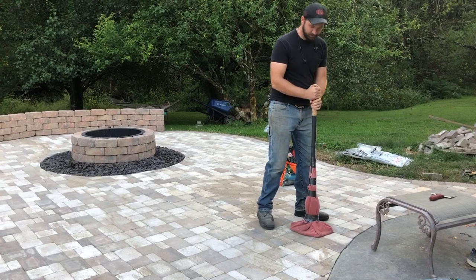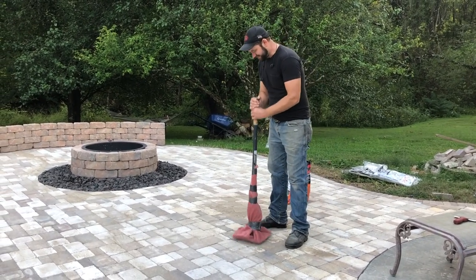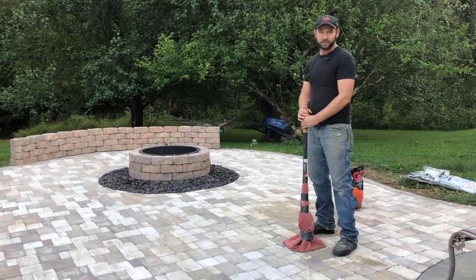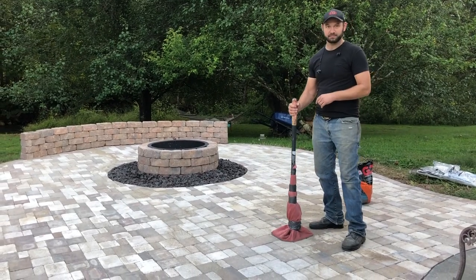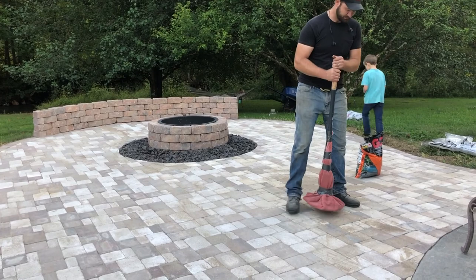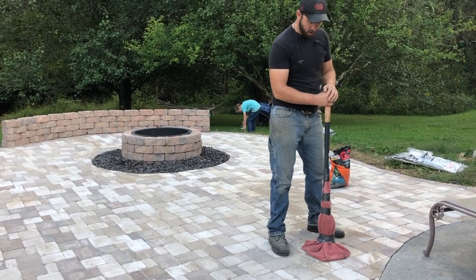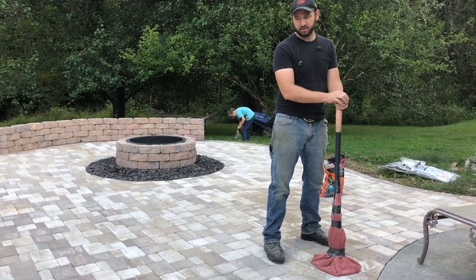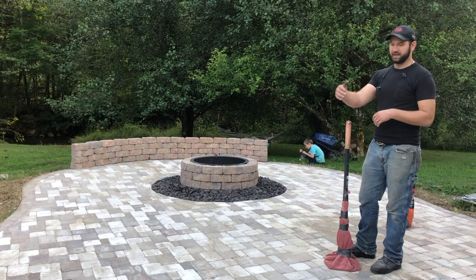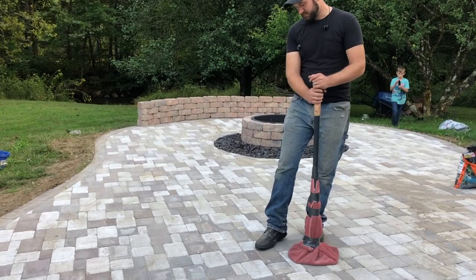Can you explain what that thing is you've rigged up right there? It looks like a messed-up broom or something. It's a hammer with a towel on it. Somebody who's going to help me out said it's easier to shape the pavers if you didn't get it perfect the first time by hand rather than automatic, but you have to put a towel on because you can crack them — especially the one that's really high. So the first time when you were laying them and tamping them we didn't have the towel on it. If the sand's in there they break more easily because they're all packed in. I'm actually hitting them pretty hard right now — some of them took a lot to get right.